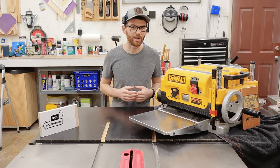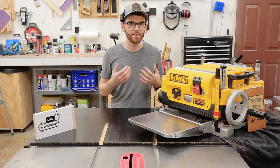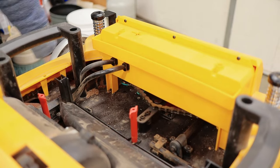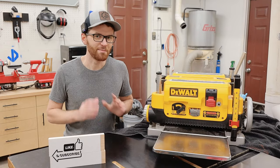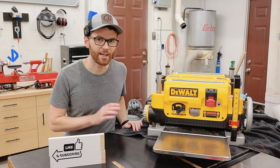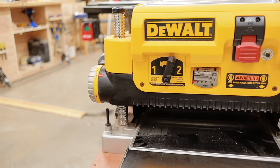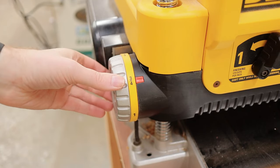There's also an automatic carriage lock that reduces the movement in the carriage that causes snipe. Since it's automatic, you don't need to activate it. This is achieved by these four threaded rods at each of the corners and a chain drive, which in my opinion is far superior than most of the lunchbox planer designs out there. Some other quick features included are a material removal gauge, thickness scale, and this really cool extra large turret depth stop, which allows you to set the material thickness to some common thicknesses that you might use.